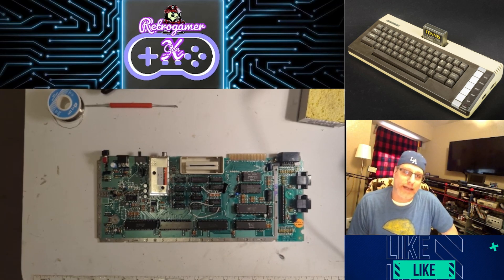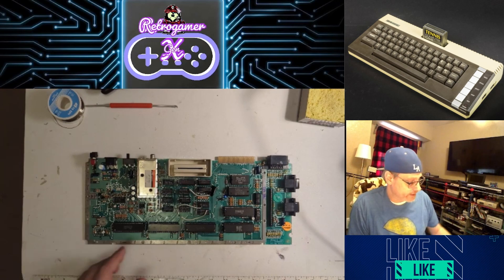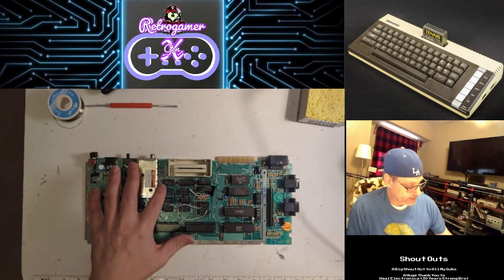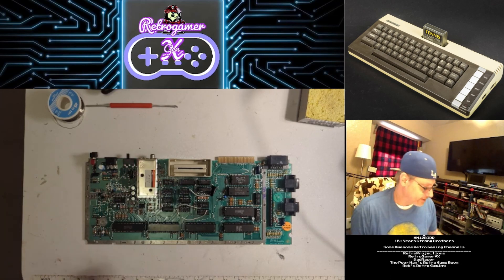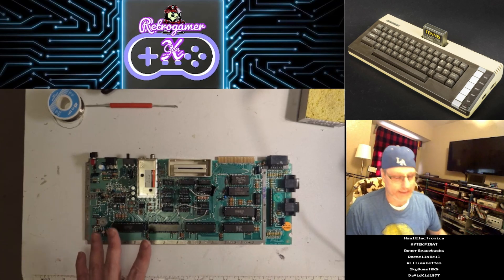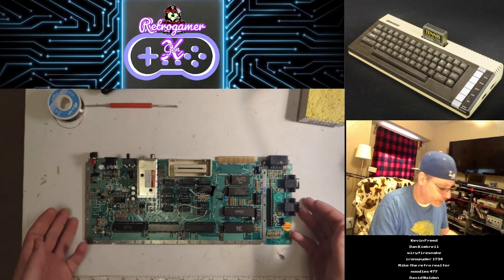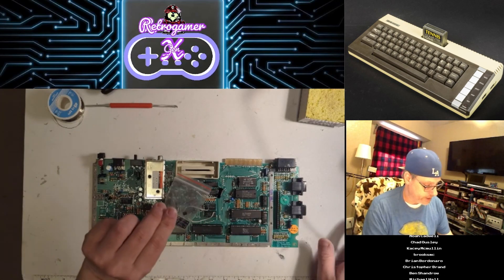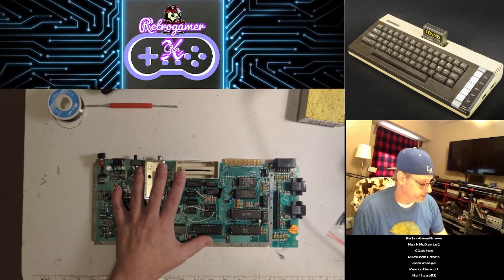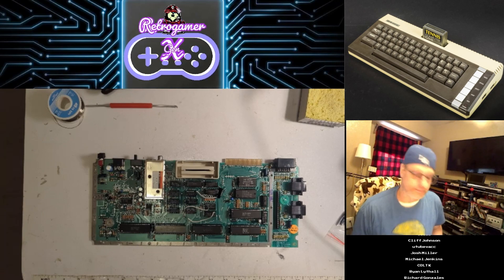Welcome back to Retro Gamer Gen X's Retro Gaming and Computing Channel. In today's video we're going to continue working on this 600XL. In the last video we determined that one socket was bad, and after pulling all the chips again I found another bad socket as well. I ordered a whole bunch of sockets so rather than re-socketing the whole board I'm just going to replace the two bad ones. We're also going to install the AV mod to get composite signal out, since this is the NTSC version of the 600XL which only has RF out.